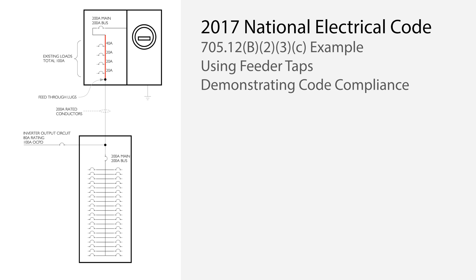If all of the loads on the meter main bus are drawing their maximum current, the current on any portion of the bus can never exceed 200 amps. The worst-case scenario is that there is no solar backfeed, the meter main loads are drawing 100 amps, and the sub-panel is drawing 100 amps. Of course, this can occur even without solar connected. If the sub-panel draws more than 100 amps in this scenario, the utility breaker will trip due to overcurrent. Alternatively, if there is solar input, it will only serve to reduce the current on the meter main bus. What is important to understand is the solar current supplied is not additive to the bus — it only serves to reduce the current necessary from the utility.